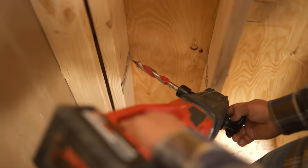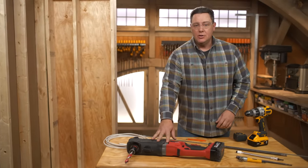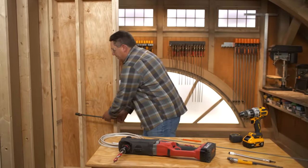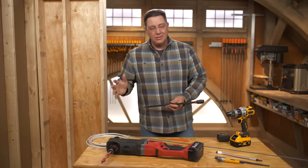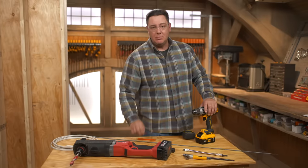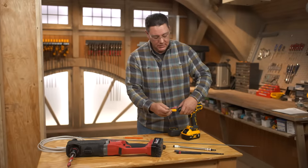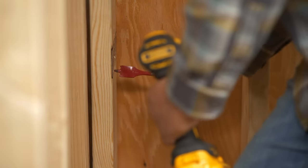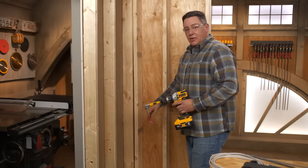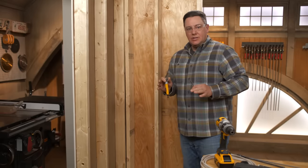When we get to the corner, you can see we can't quite square up the drill because the bay is not full-sized. So let's look at our options. For this drill they do make larger bits and extensions — we could attach something like that, but even with a smaller bit we may still have a hard time getting into that spot. It's great for some applications, not for everything. The next option I tend to use in corners is this drill with the spade bit we spoke about earlier, combined with the right-angle adapter — that's how I fit into a bay comfortably when it's a little too tight. You can see that angle fits in the bay pretty well.